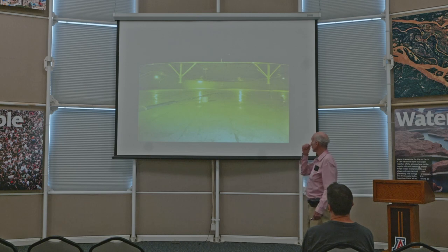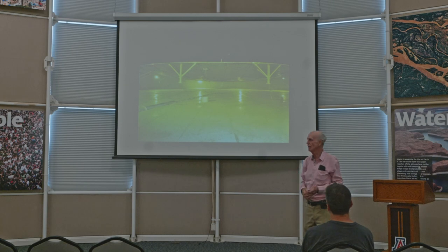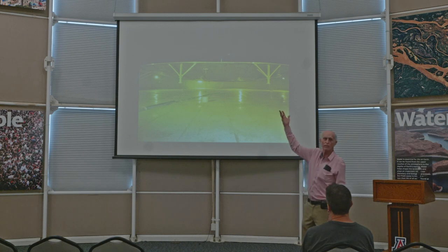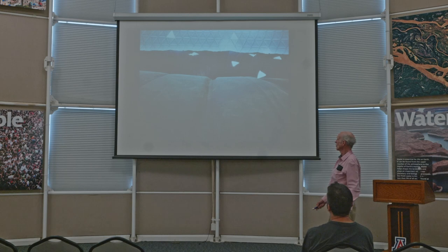So this now is after the membrane has been attached to the pan and the edge of the tank, and the air has expanded enough so that it is pushing up underneath, and it's raised that aluminum pan off the floor, including the membrane. And that weighs 20 tons. And it's just the expansion of air. And you don't even feel it. But in this case, this is only a very small amount of rise, maybe 6 or 8 feet or something like that. The range of travel that it was designed for was 45 feet of movement. Next slide. And then that's looking over the top, but underneath the dome. The dome is in the background, and you can see how these membranes are billowing up. Next slide.